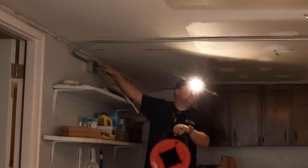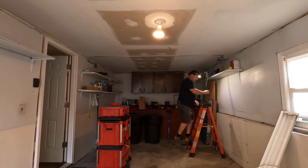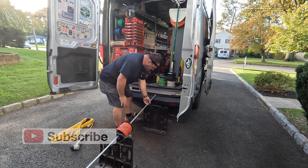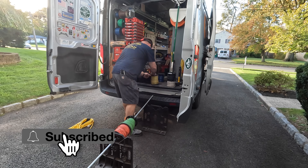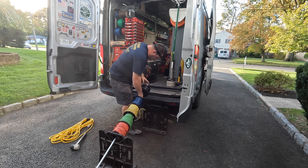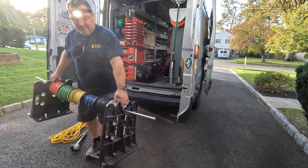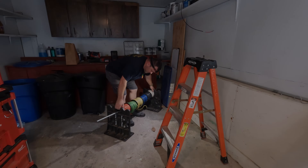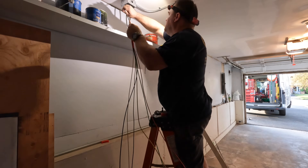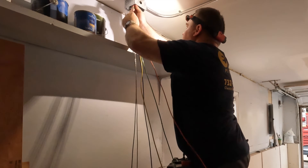I'm a little upset using this fish tape rather than the M18 mechanical fish tape because the cartridge got bound up inside — this happened to a lot of people based on reviews and they just stopped using it altogether, which is unfortunate. I'm not going to buy it again for $200 and have it break after the fourth or fifth use. Here you can see I'm running three colored conductors and a number 10 equipment grounding conductor, plus black and white for my 15-amp circuit. I actually just pushed it right through rather than pulling.